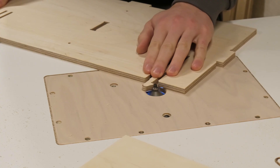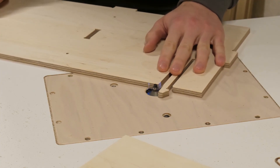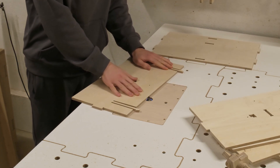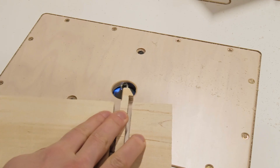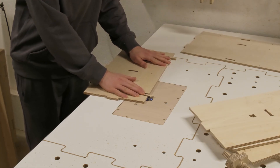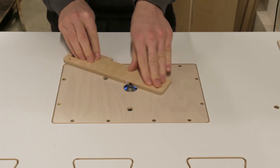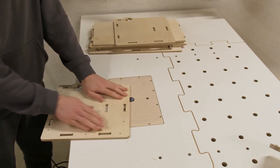But before that we have to carefully trim the edges for the clip tenon component. We have to pin the clip end to the work surface to keep it from wobbling around or snapping off. This means my fingers are way too close to the blade, which isn't ideal. Using a push block to hold the clip in place would have been a smarter approach.